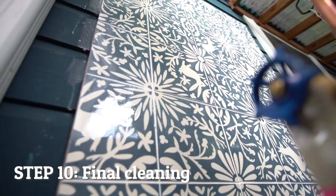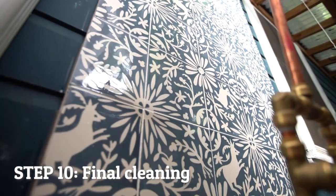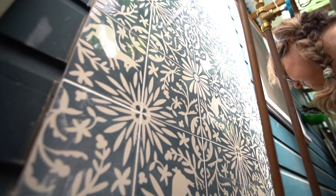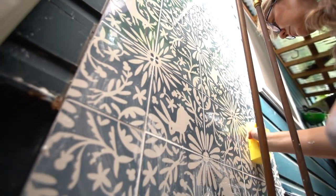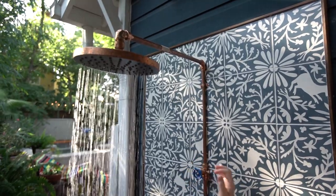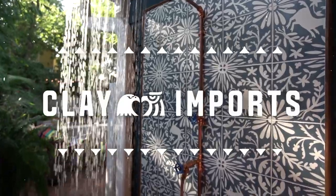This residue can be cleaned during the final cleaning. For the final cleaning, 24 hours after grout application, use a combination of mild detergent such as dishwashing soap and warm water. The final cleaning should remove all remaining residue from the tile surface. Though there is no substitute for experience, following these instructions and taking your time will result in a pretty good tile installation.